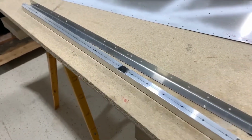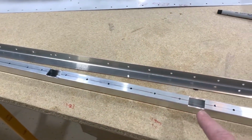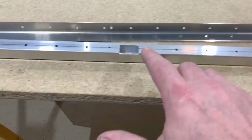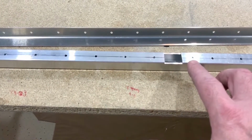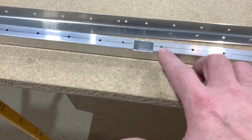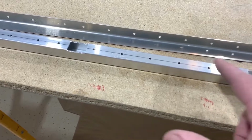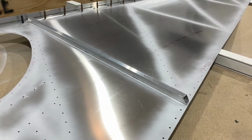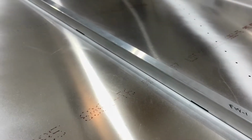And just so I wouldn't have a rivet go in where these slots are, I did stagger a hole or 2. I can't remember which ones I used now. Maybe this one here. So there's gonna be a couple holes that aren't lining up. I think this one here, and then over here maybe this one. And these will get up drilled, according to the video, to A5 holes or size 20 holes. This is where the new F18-1 will be installed. I won't rivet this down until the straps for the header tank are installed first.